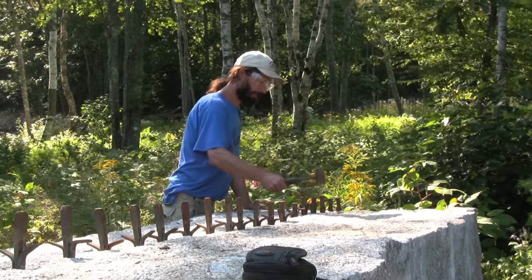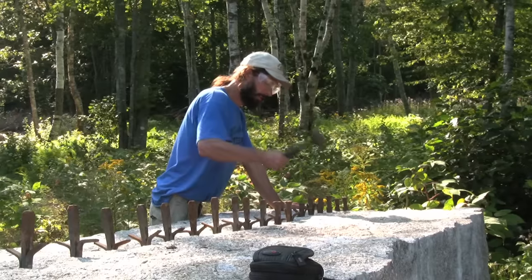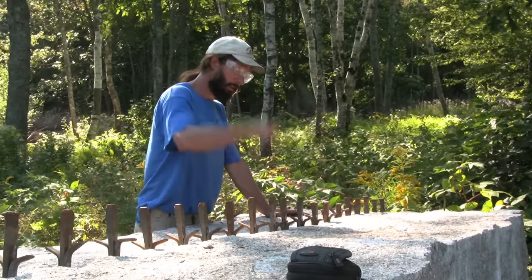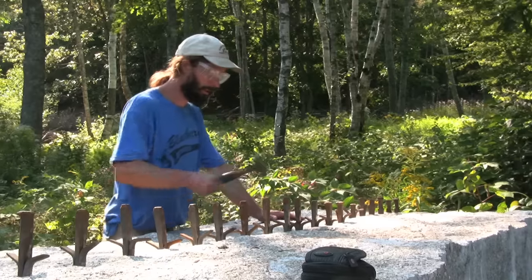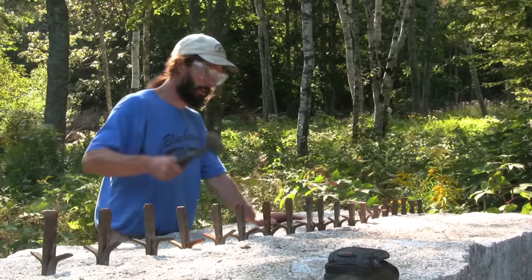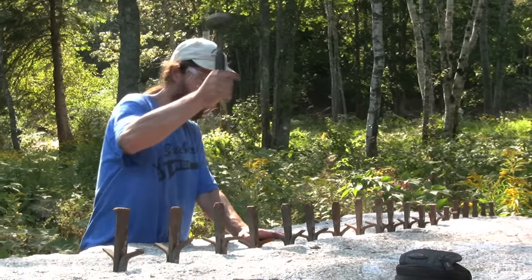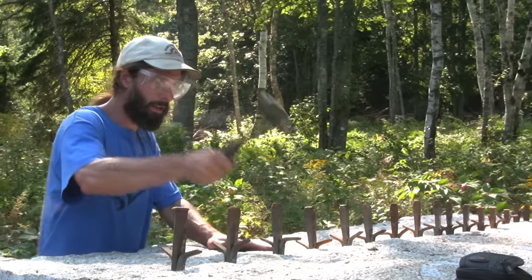As you drive the wedges, a small crack forms between them. If you listen close you can hear the crack shearing down through the stone. You want to do that slowly because different cracks are forming through the crystals, and you want them to go slow because they'll be attracted to each other given the time. So a split like this you want to take about an hour.